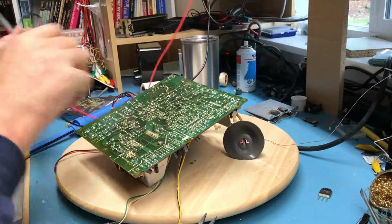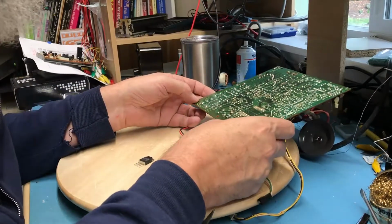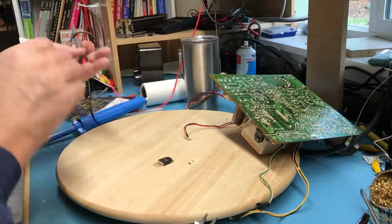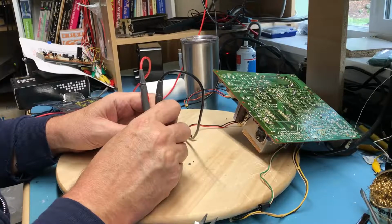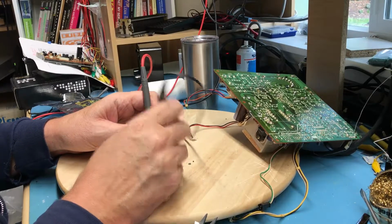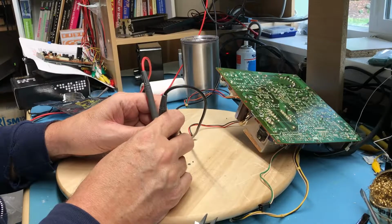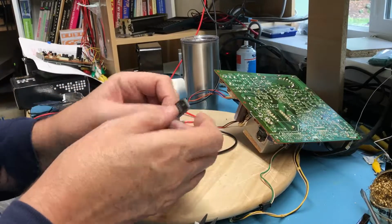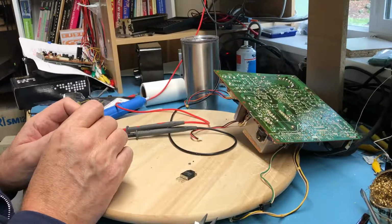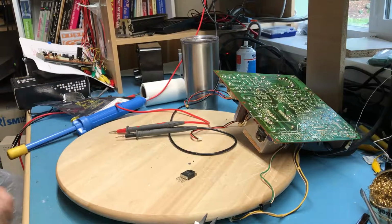Well, I'm encouraged in that this transistor, which came from back up here, there's the base over here to this side. And I see a normal diode forward. I see a short. I see a nice open from base to collector, and I see a short again. This guy's definitely dead, so I will see if I can cross-reference this and order one of these as well. We've got some capacitors to order, and we'll come back to this once I get the parts in. So, we're moving ahead.